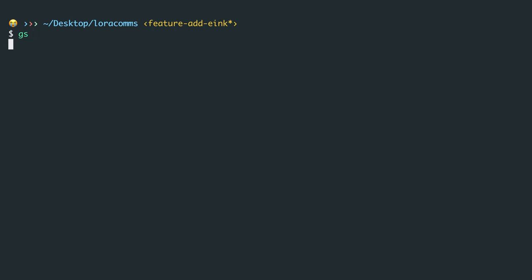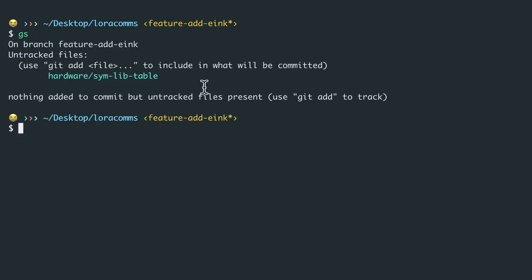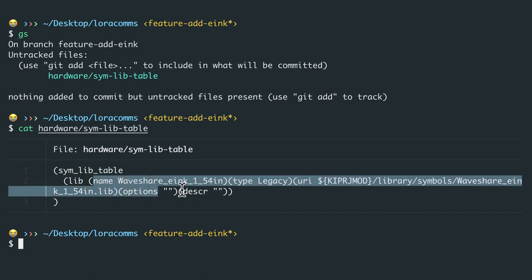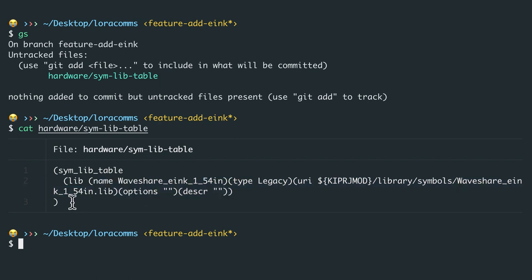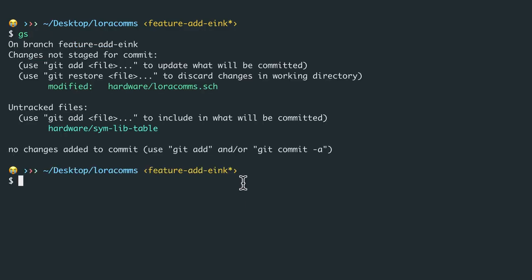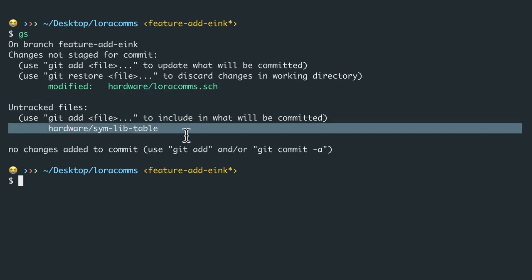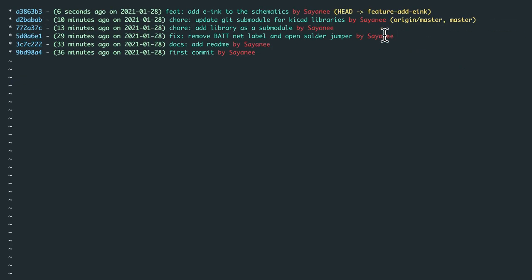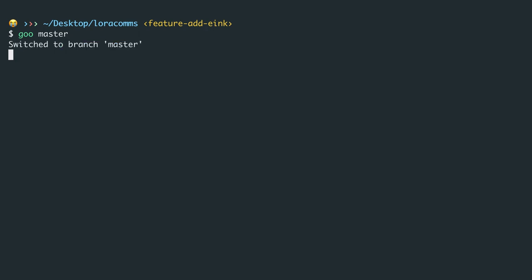I'll add the path by clicking the folder symbol and adding the Waveshare e-ink module. Running git status shows a new file is created. The file is in ASCII so we can somewhat read and deduce what it's doing, though editing it would be error-prone. The schematic doesn't have the symbol integrated yet, so the electrical engineer will now integrate the new symbol. After integration, the ERC is also passing. Git status confirms the schematic and symbol library table have been changed, so we'll commit 'feat: add e-ink to schematics'. Looking at git log, you can see the branch has diverged from master into the feature branch.